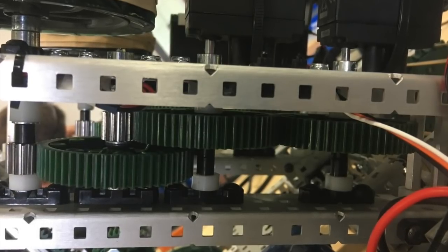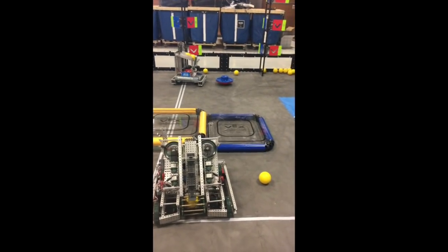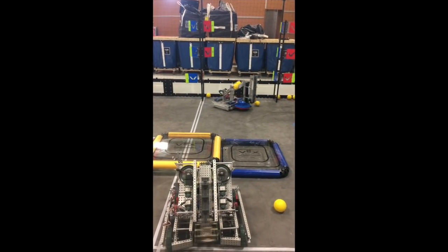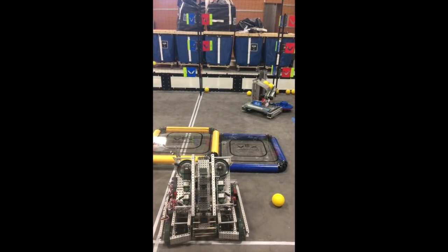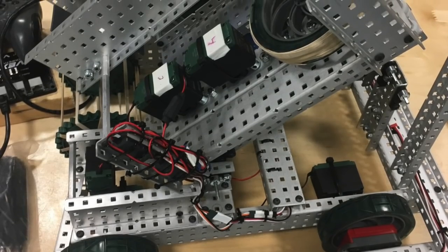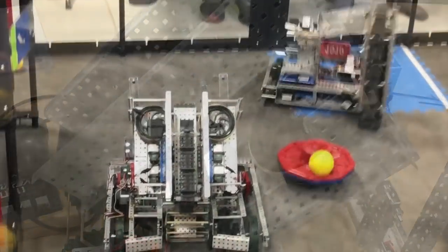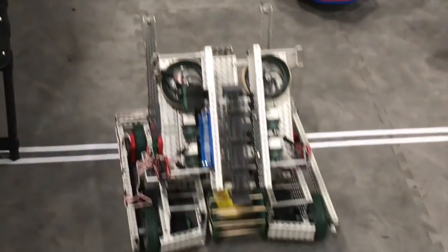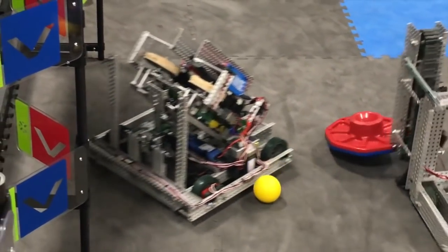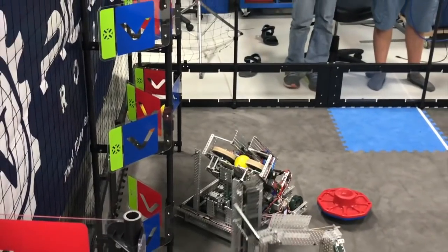After a lot of work checking the axles to make sure they weren't bent and trying to defriction it as much as possible, the flywheels could easily clear the fence from the other side of the field, so the aiming system was quite helpful. A similar effect could be achieved without the aiming system by just manipulating the motor speeds. I've heard that teams in the past used encoders to track the RPM of the flywheels, so that's something I plan on doing in the future. We used rubber bands to increase the diameter of the flywheel slightly, helping to grip the ball better than the wheels would normally. The flywheels were all in all really good and fairly reliable, so I'm super happy with that.